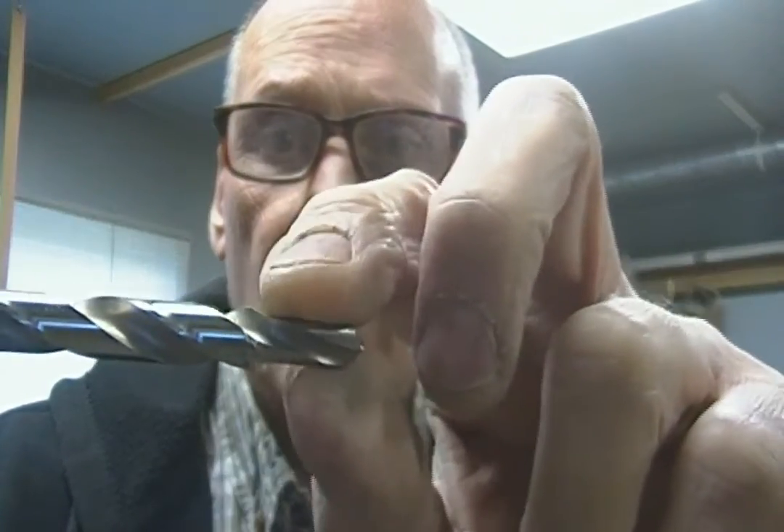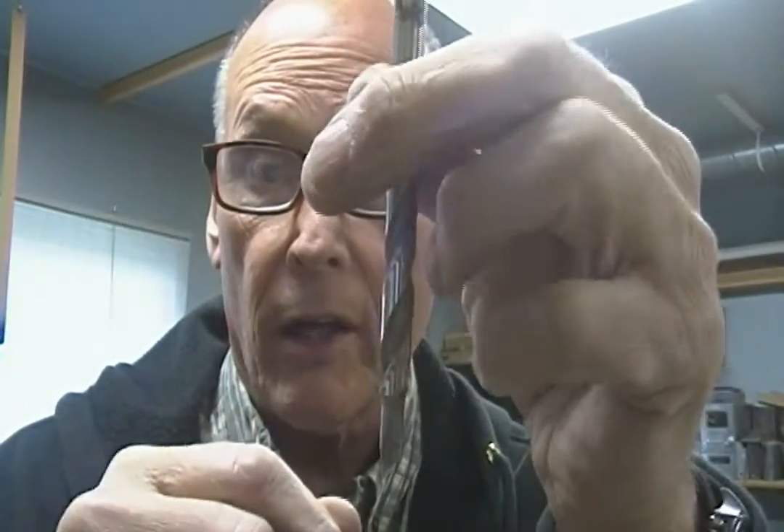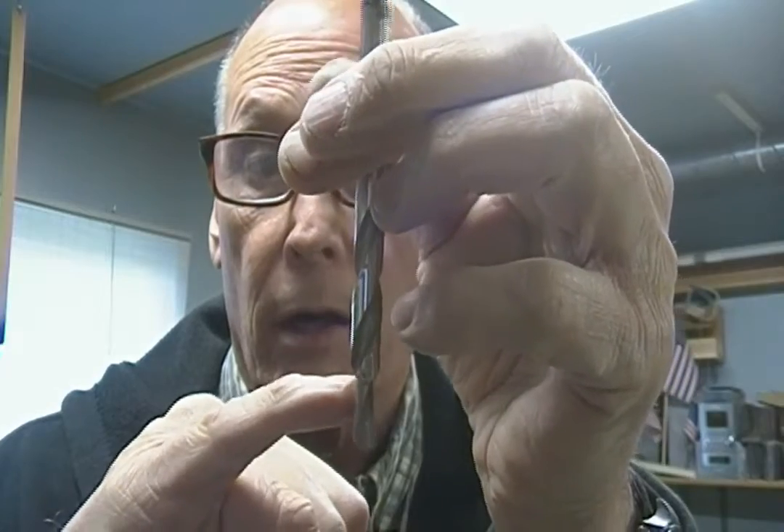I ground this part down to a quarter inch. And I was thinking I'm just going to overthink this. I was thinking about getting in there with the drill, putting it in the drill press and letting it spin and then cutting a little undercut on this with my Dremel or something.